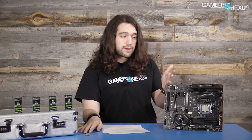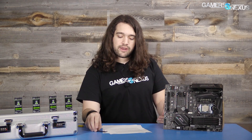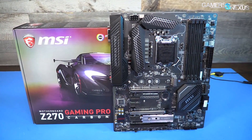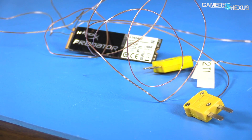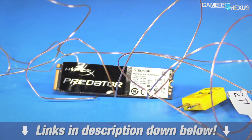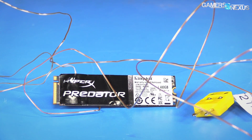Takeaway: stick around for the full review. The board might be worth buying for a Z270 platform, but if you do buy it, just don't put M.2 SSDs under this shield. That's all this is setting out to say. Thank you for watching. Click the Patreon link in the post or go to patreon.com/gamersnexus to help us directly produce this type of content — it's fairly research-intensive and we use expensive self-adhesive thermocouples. Subscribe for more content and the review.